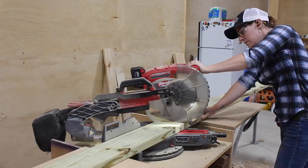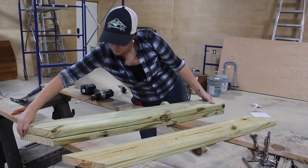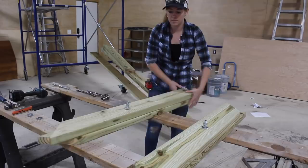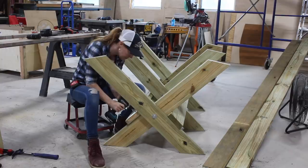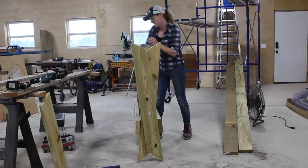First I wanted to set all this equipment aside and quickly build a log stand so I don't have to cut all of these logs on the ground. I went with some two-by-sixes with a steep angle cut in at both ends, then a hole drilled in the center. I flipped them to be opposite of one another and stuck in a bolt with a few washers and nuts — using two nuts so the joint keeps pivoting, making the stand foldable. After repeating to make three of the same, I lined them out, used a clamp to hold them in the open position with feet flat on the floor, then placed another two-by-six to tie them all together and create a hard stop. Depending on your log length, that determines how many of these X's you include.